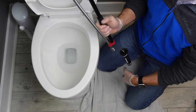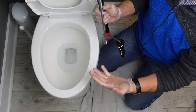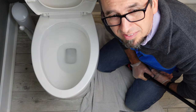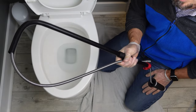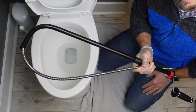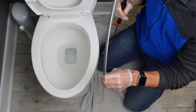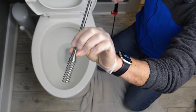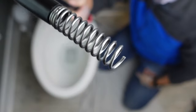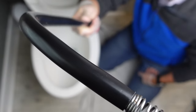The towel also gives you a place to put some of the things that you pull out of the toilet — toilet paper and other bits. Now, this auger — I'll include a link for the auger I'm using in the description below, and I'll also provide at least one or two other good options you can choose. The key with the auger is to make sure that you take the very far end, the springy end, and get it all the way up to the end of the actual shaft of the tool. You don't want to just put the spring in without using the natural curve of this tool.